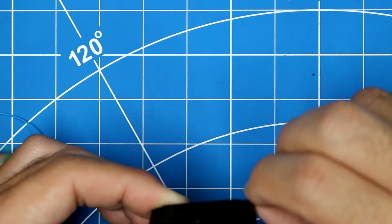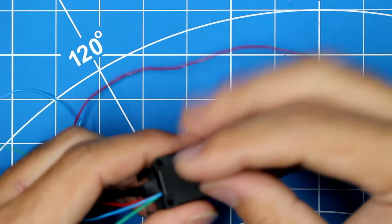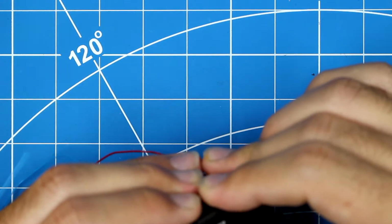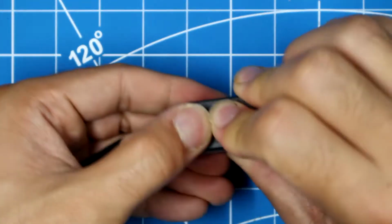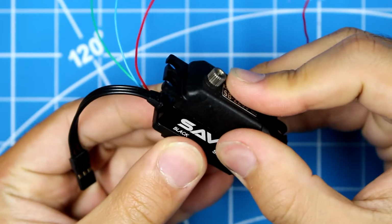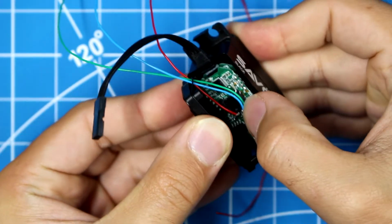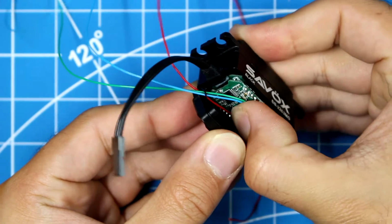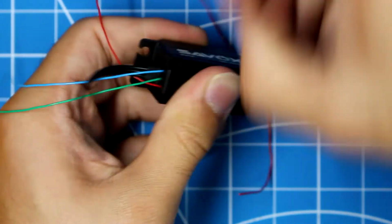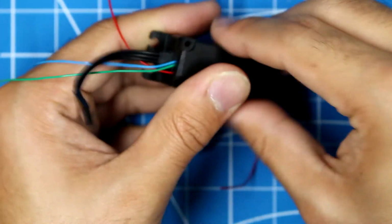And so now you can just route the grommet into its slots. Once you're done, the servo should be easy to put together, and you just screw it in. If you're having clearance issues like me right now, you need to make sure that it's not hitting this chip in the middle. So just pushing on the side a little bit, bang, boom, and we can just, whoops, let's pass all those cables back out of this hole properly.